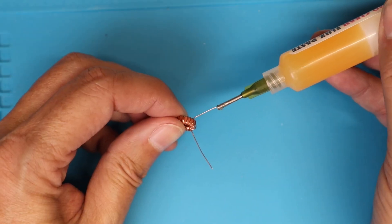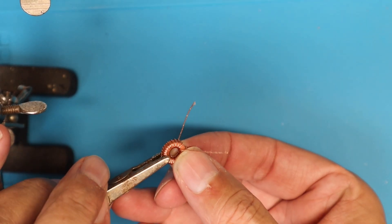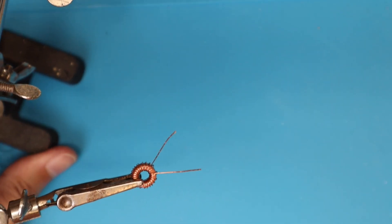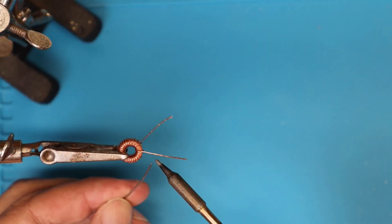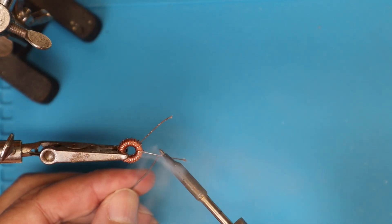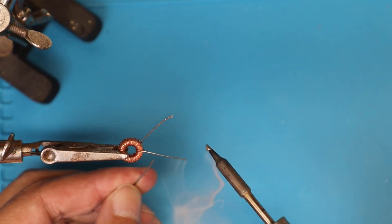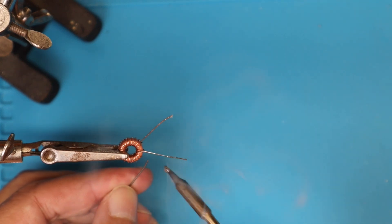Next, I like to tin my wires. One word of caution: make sure your PCB holes are large enough to support doing this. Flux is your friend here. I add some flux and hold the toroid in a clip — you do not want to hand hold this as the wires will get hot. I also point the wires down a bit to let gravity carry any solder blobs toward the end. I then take my iron and touch the wire, adding a little solder as I move it toward the end of the wires, often running the iron over the wire a couple of times to get a smooth tin.